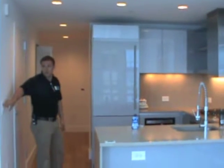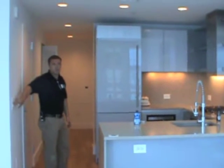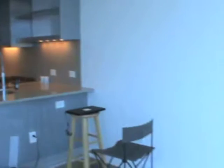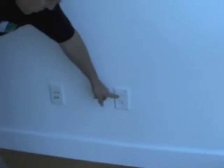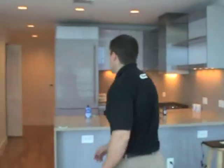You also have one more switch — it has a red dot next to it — and that switch is going to operate a switched outlet, which coordinates with the red dot of this outlet over here on this wall. So for instance, if you would have a lamp plugged into this outlet with this red dot, it's going to allow you to turn the lamp on and off with that switch.